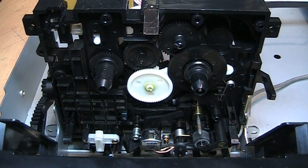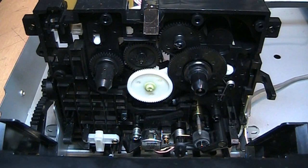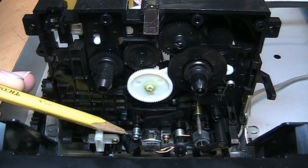and pinch rollers. And if you want to talk about cassette decks getting cheapened out over time, I wouldn't blame Tanashin because as cheap as their mechanisms were, they were always based on a metal frame. While it seems like Sony's mechanisms, especially in the 90s, were made from as much plastic as possible. At least in this one, the head is still held in place with screws.